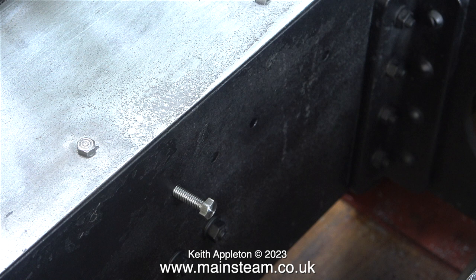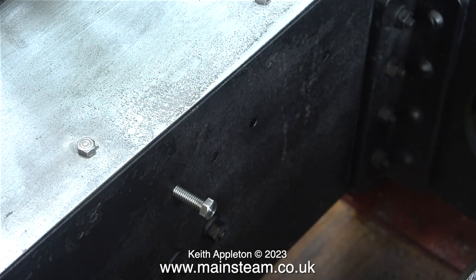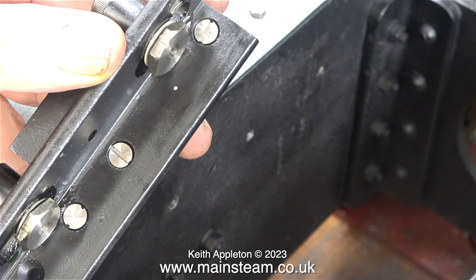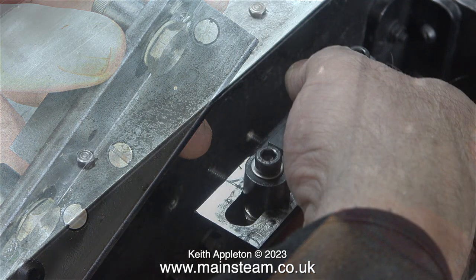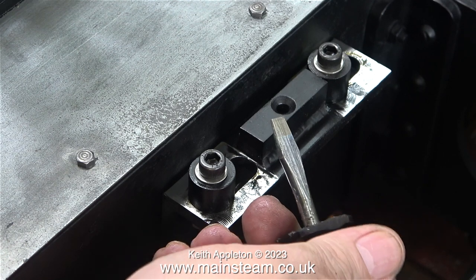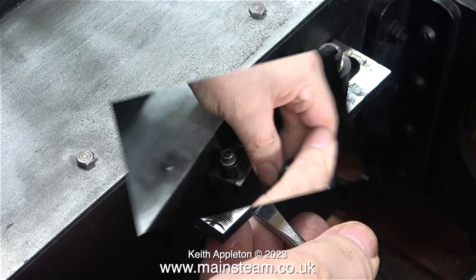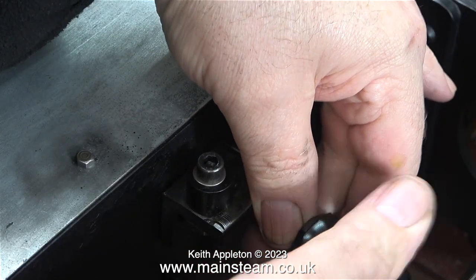Just as a test, I'm using a one-inch long hexagon 2BA bolt to make sure it fits, and it's a bit tight in the hole. Using two three-quarter-inch long bolts and two one-inch long bolts, that should be fine to hold the bracket to the frames. I was a bit concerned about 2BA bolts holding this weight, but they will be plenty strong enough because there are seven of them and the load will be spread well. When fitting the first bracket, I made sure three fingers were covering the three bolts, so they could all be pushed into the holes simultaneously.